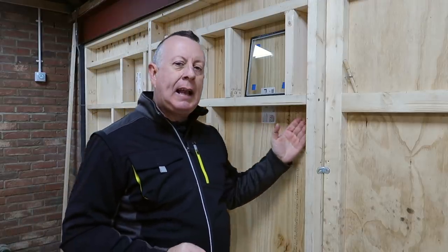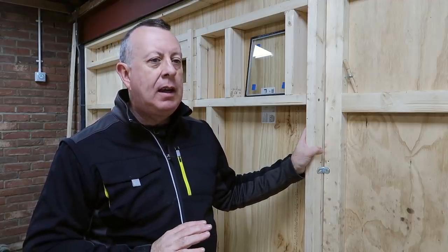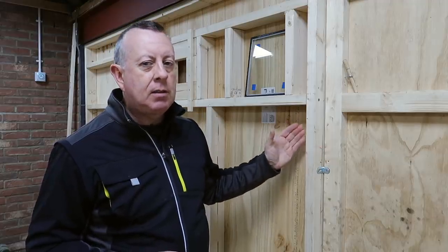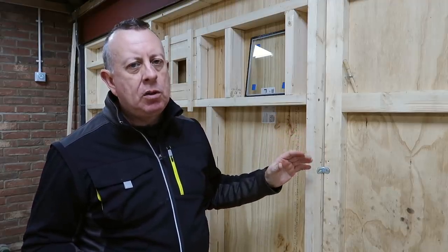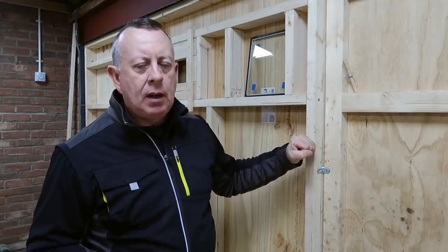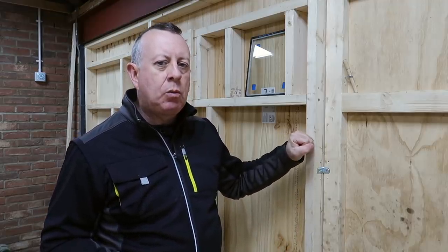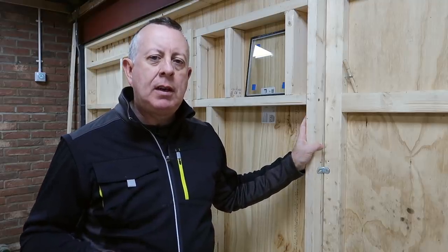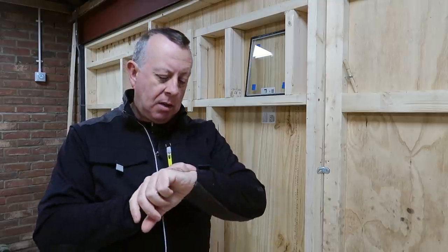So I've got three things left to do now. I've got the cladding to go on the outside of this wall to make it look like a standard garage door. And unfortunately, because of lockdowns, I can't find any pressure treated cladding anywhere at the moment, so I've had to go for standard redwood. I've got the insulation to go in the middle of this void and I'm just going to be using standard rock wool insulation — it's fairly cheap and cheerful. And obviously the last thing to do is to clad this side of the wall. I'm going to be using plywood rather than plasterboard, as this is a workshop and I think I'll be fixing things to this wall for the next few years.